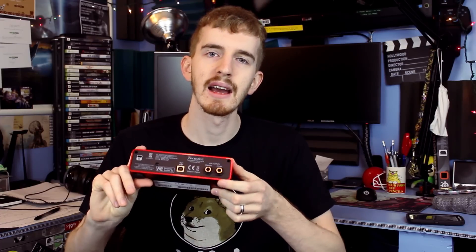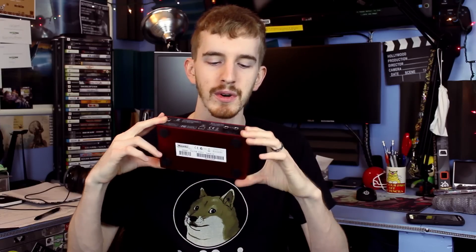And when we upgrade that second microphone to a dynamic, that will no longer be the case. The second output via line-out is also very clean and high quality. This has been one of the biggest issues I've run into with mixers in our setup — running a secondary output to our second recording rig either involves using multiple ground loop isolators at various points along the setup to eliminate electrical noise and interference from having two computers hooked up together, or it's just been way too noisy and too crappy of an output to actually use effectively. This one works perfectly. We can use our second rig as if it were our main recording rig without really ever noticing any difference. The left and right are still set to separate microphones and it's pretty high quality. There is a tiny bit of extra noise on that side when recording on the second computer, but I think that may be coming from the condenser microphone since it picks up more than the dynamic, rather than from the interface itself.